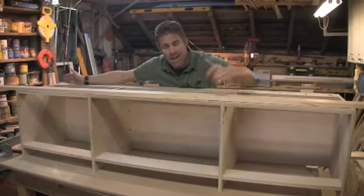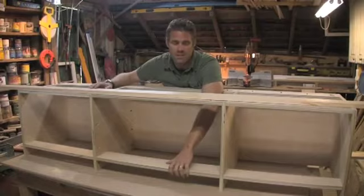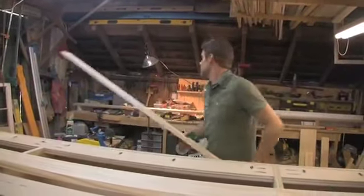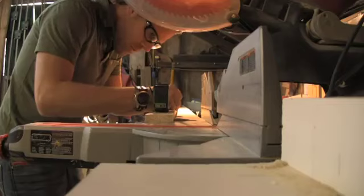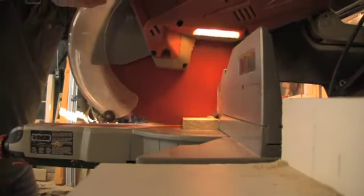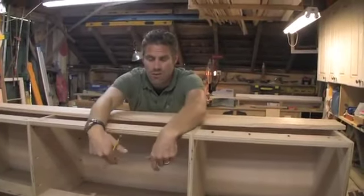And then cut your stiles. Cut them at 13 inches, and then put them all together. So it's time to head on back to the miter saw and make 2 cuts at 74.5 inches, which is the length of our box. Okay, so now you cut your 2 pieces. This is going to be your top rail and your bottom rail.